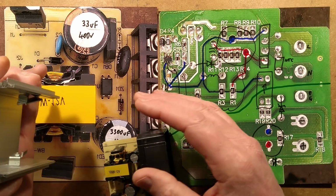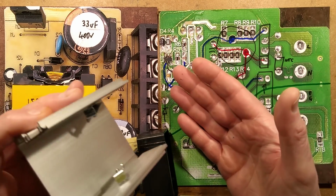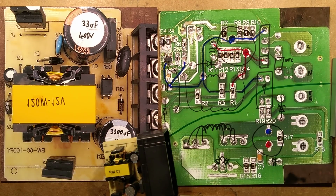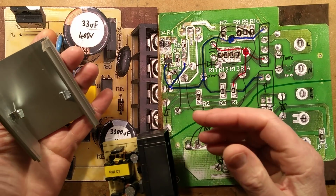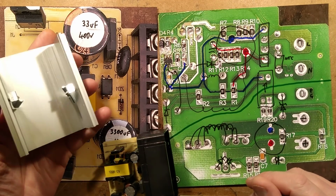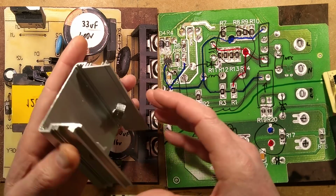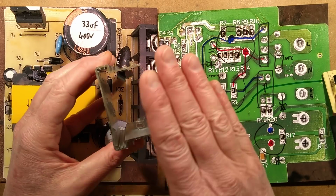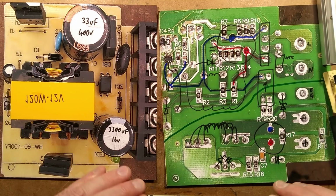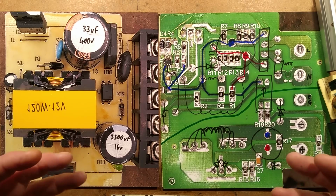If we had this mounted as they show it in the listing in Edinburgh somewhere on a wall, when the haar came in, water would just be dripping out the inside of this. So I don't know what their application is. I could imagine that maybe they might use them inside a sign, and it's just a little layer of extra protection in case water drips in. I think that's all I'd really consider it for, inside a fully enclosed box sign, where the metal case is earthed in its own right, and this is just an extra layer just to stop water dripping from above onto an open power supply. But it's smart enough. It's nicely assembled, even if it's not quite rated for how they actually expect it to be used.